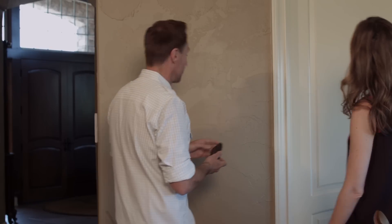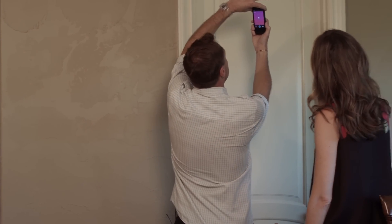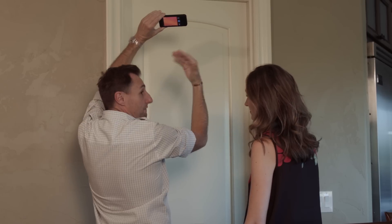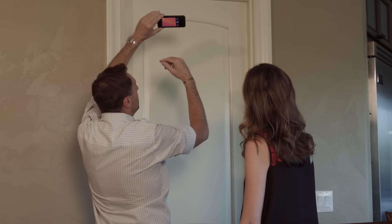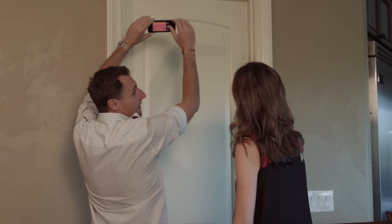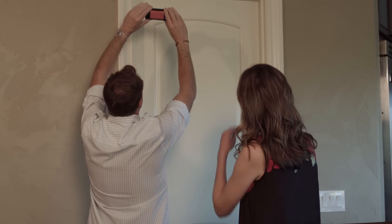Now that we've got the shower water running, what we want to do is just tune the device to make sure that it's accurate. The FLIR One is going to measure the difference — what we call delta T — between the surface of the ceiling and the water that is now, hopefully not, seeping into your ceiling.